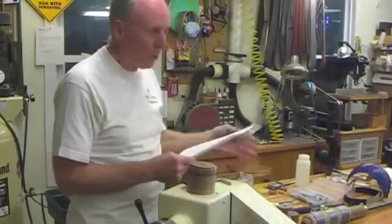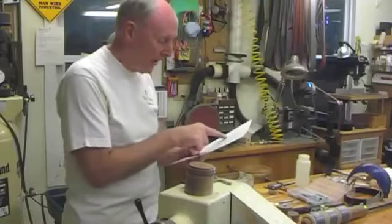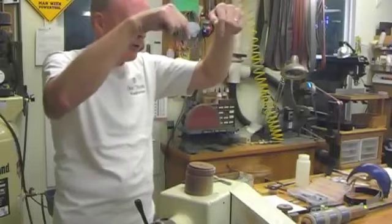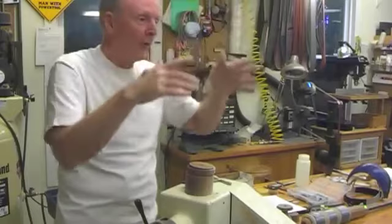Attach the faceplate to the workpiece while we're going to use it. You're going to make a tenon on dry wood. Number seven, when you're using green wood, if you're going to have a small top, the screws are going to go into an area that's going to be removed anyway. So you can use pretty good sized screws. If you're doing the Grecian urn with the short neck, then you need to be careful about the length of the screws that you use. But those screw holes will be turned away when you're using green wood.